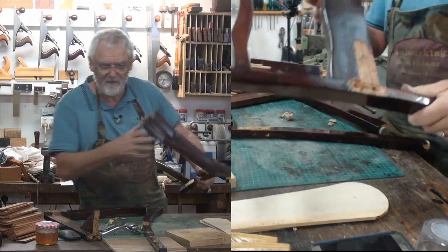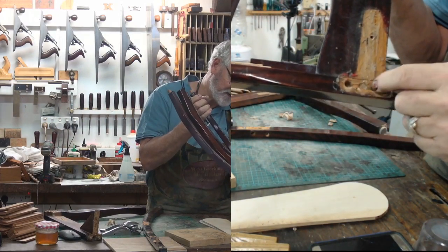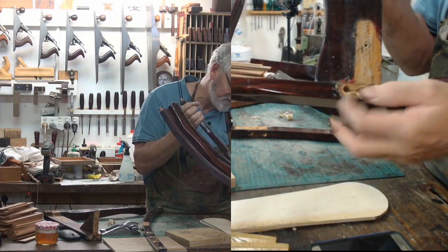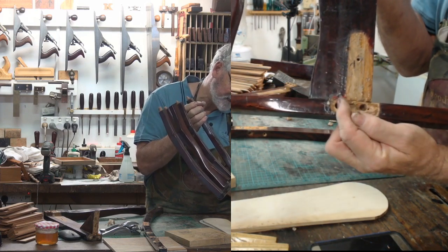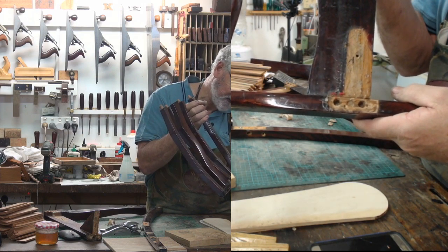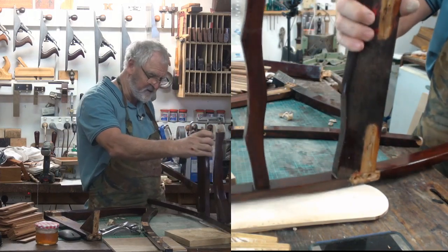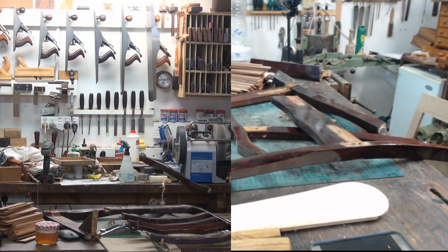And if you look at that, that's loose. This is the chair back, and that's pretty munched out. But what I want to do is take this out, and instead of cleaning all that out, we'll see if we can just put a couple of little bits of timber in there, so we've got the same angle and placement of the dowels. So it's going to be easier to put together. Whereas the other one, we've got to actually figure that out, and it's a bit of a hit and miss to get it right. But I'm sure we can do it. Let me just get a bit of scrap timber.